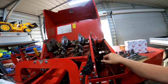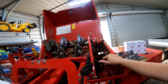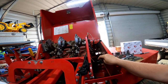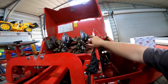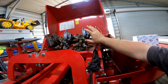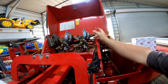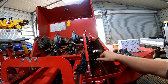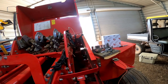With the 37, I tuned it up and had everything working good, and then all of a sudden it started having some issues. I pulled out the book and started measuring all the parameters — everything it was supposed to be set at — and I realized a lot of the parts were worn out. We ended up replacing the bill hooks and basically completely rebuilding them for what needed replacing, retuned and set everything, and from that moment on we had no more knotter issues on it.